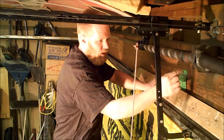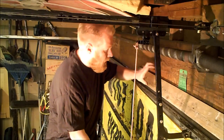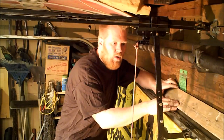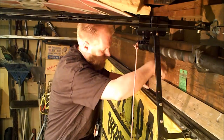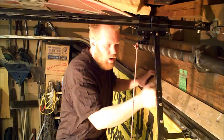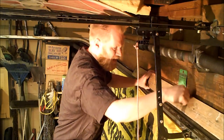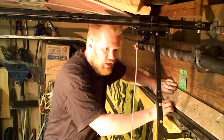And even if you were able to weasel a hanger up in there, you can't see, you can't get up around to do anything. The longer, almost the better. This is 3/4 inch by 3 and a half inches — you can do whatever. The idea is you want to screw it at an angle. I have kind of a ridge right here where I don't even have to bevel this or anything. I can just screw it down and angle my screws, and that will hold it square in there at this angle. There's no longer a way to wedge a hanger up in here and get that angle. And even when you do, you're just pulling straight down with so much friction — you're not going to be able to unlock it. We'll just set that there and drill a couple holes, screw this down, and I'll try again.